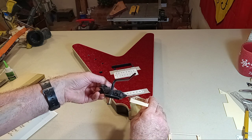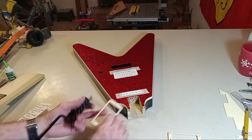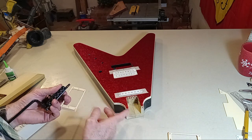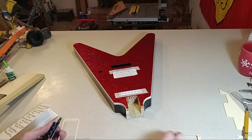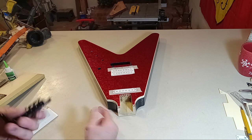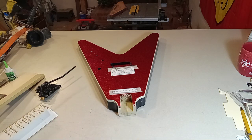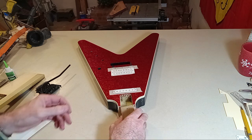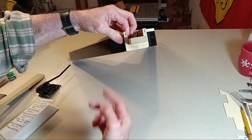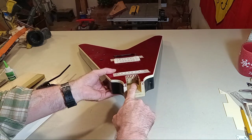We might need to do more engineering — measuring the taper path across the tops of the pickup rings, and deciding whether to tilt the Floyd Rose to go with the string path or run it flatter. But we at least have a starting width, depth, and dimensions. And if a mistake happens, don't panic — just grab some epoxy, cut a little fillet, glue it in, let it dry, and then re-route back to your target. You can recover most errors with epoxy.